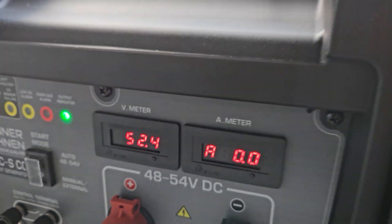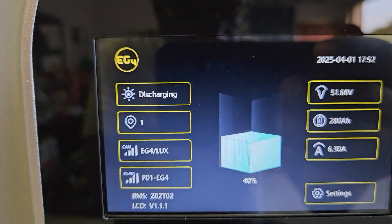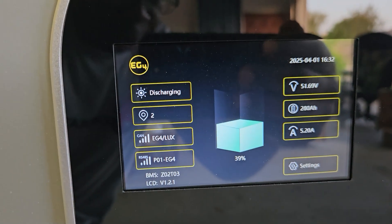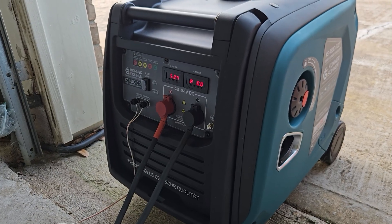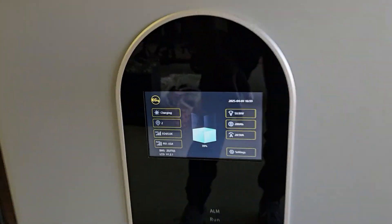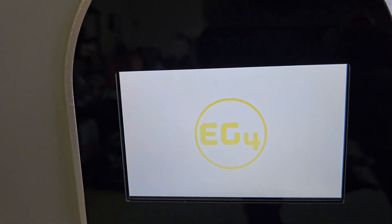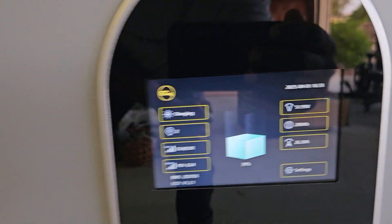The generator is letting itself warm up — it's not pulling any amps yet. Looking at the battery display, it went to 39% and started right up, but we're still discharging while it warms up. Once warmed up, it switches to charging. Battery one is now charging at 27.6 amps, battery two at 28.1 amps — the charge is being shared between both batteries.